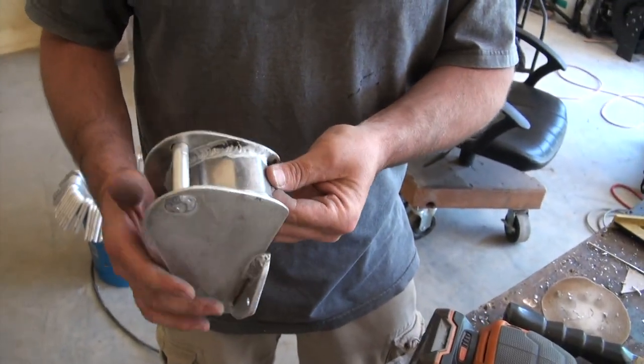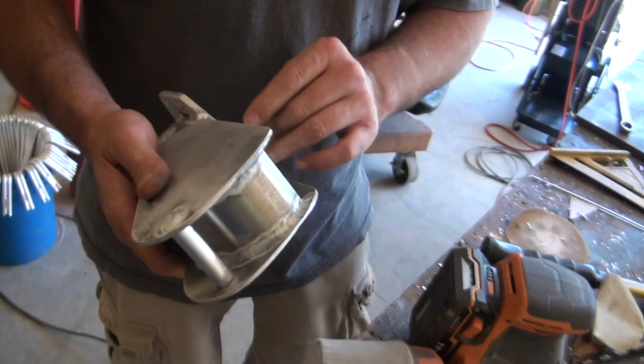Here's what we've got - the anchor boom with a nice contoured bend so the cord runs smoothly over it. The rope that the anchor's on runs over it, and there's a rod we put through with a slight bend - you can see it'll keep the rope centered on the anchor. I'm just marking them where they need to be cut, and then it'll get welded into place. Once it's welded we can make the base, drill the holes, and get it bolted to the boat. Just sanding it down to get all the rough edges off and make sure there's nothing sharp that's going to cut the rope. Then we're getting ready to throw it in the sand blaster to get a good rough surface so the paint sticks really well.